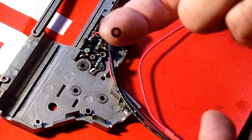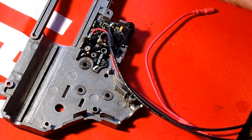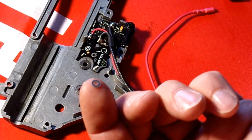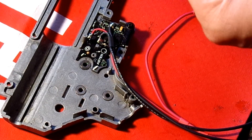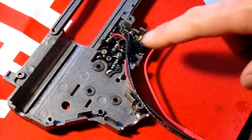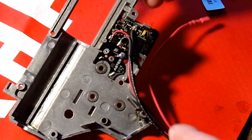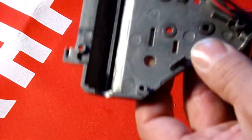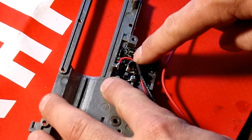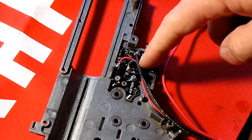I'm honestly not going to test that theory — I just know that this plastic one goes first and that's what I'm going to do. Now you come with two additional washers, the silver colored ones. These are for spacing. On the back side of the gearbox it's possible that the screw head might protrude. I was able to get that screw in — luckily enough for me, I only needed that rubber washer and one of the metal ones. Now when you're putting this in, go slow and you want it to be snugged so it doesn't move. You don't want to over-tighten it because you will probably crack the board.